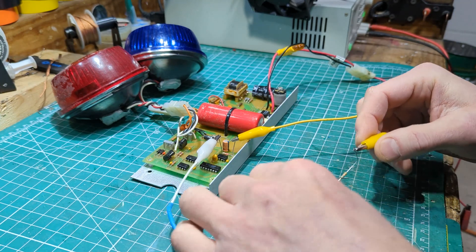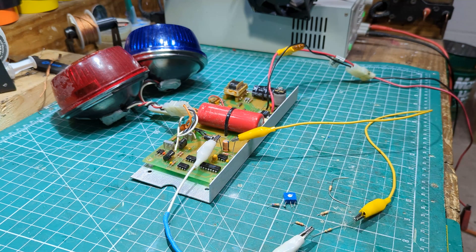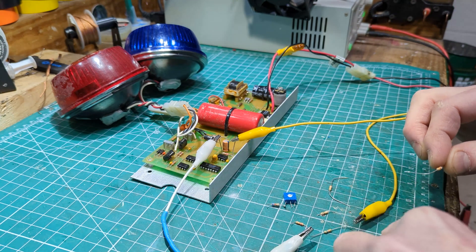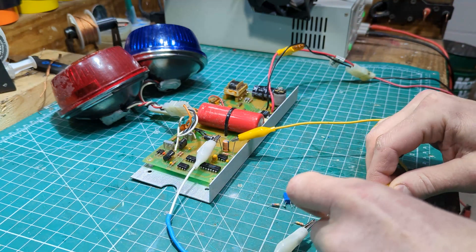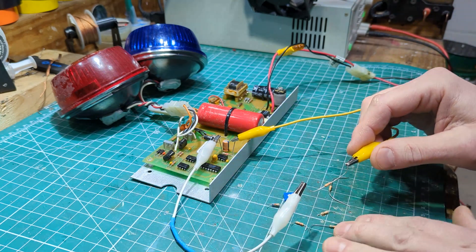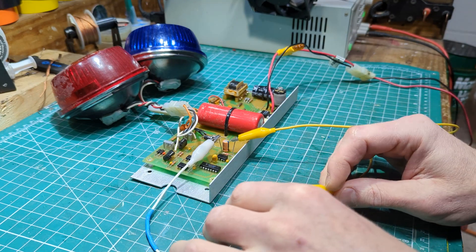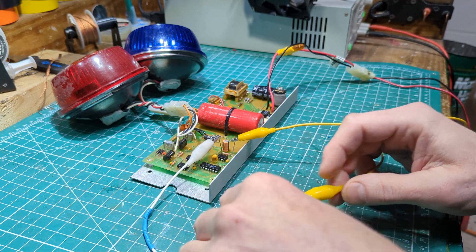Usually I wouldn't make a chain of resistors to test something like this, but for visual purposes for the video I went ahead and did it. When swapping resistors in, you can do trial and error knowing that the factory rate would be a 19k resistor — you could just start pulling slightly lower and slightly higher values until you get what you'd like. You could also use the Digikey website's 555 timing chip calculator tool, where when you know the value of your capacitor and your two resistors, you can plug in different values and see what sort of waveform you get.